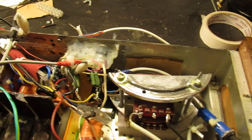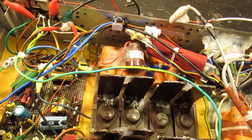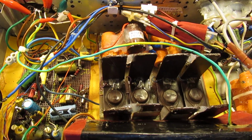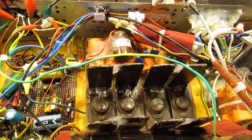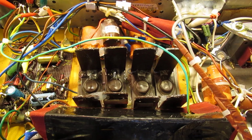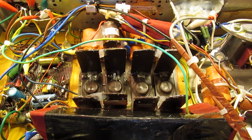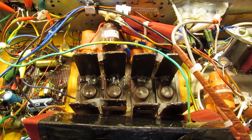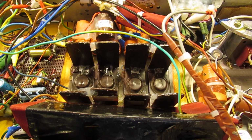And well, I want to show you now some music, how this amplifier sounds. That's always very important, of course, how it sounds. Yesterday you saw on the oscilloscope that we had a kind of distortion when I sent in a very high frequency of 20 kilohertz or so, and it was a square wave. You saw distortion into a kind of sawtooth wave, but anyway,